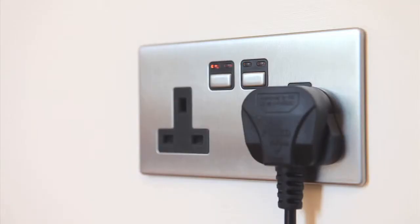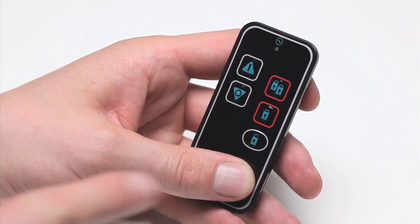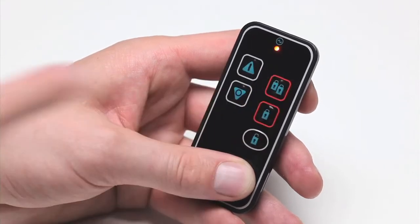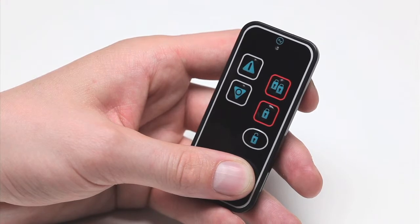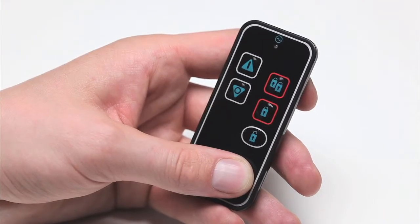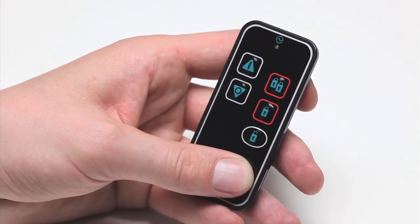A locked device is signified by a slow flashing amber LED or simultaneously flashing blue and amber LEDs. Pressing the double lock button locks the manual buttons on the linked device, but will also prevent any other LightwaveRF remotes or the smartphone app from issuing RF commands to that device. To unlock a device, press the unlock button on the locker.